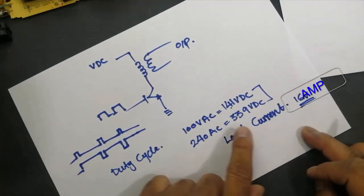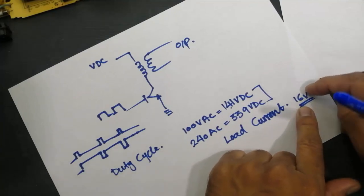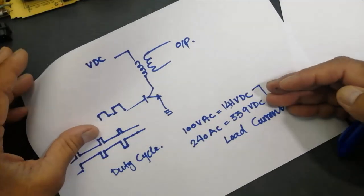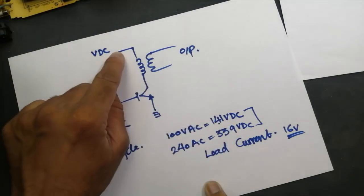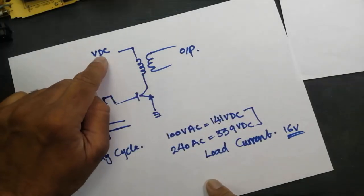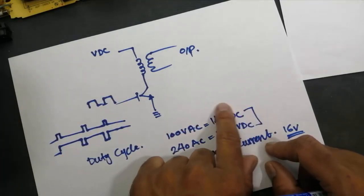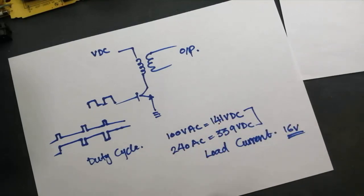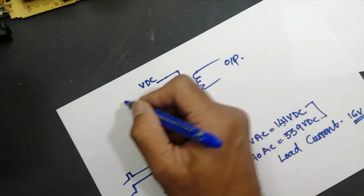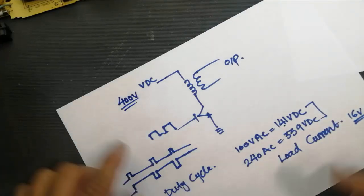Any power supply must work at the lowest voltage and maximum current. So when we need very high current or good efficiency for a specific device, we must regulate this level so that the IC works properly. To compensate for this regulation factor and the efficiency of the converter, the PFC circuit is used to regulate the DC bus — adjusting the VDC voltage to 400 volts even when there is variation at the input.